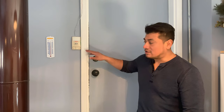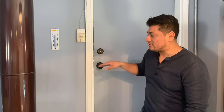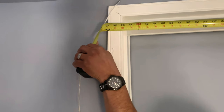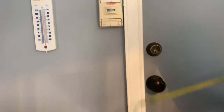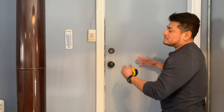Now that we're outside, we can take the exterior measurements. These are basically from your edge of the brick molding — this piece here — to the outside edge on the opposite side. On this one we want to take measurements at three points, because a lot of the times they're not the same. We want to choose the smallest size. At the top we have 36 and 1/8, and in the middle we also have 36 and 1/8.